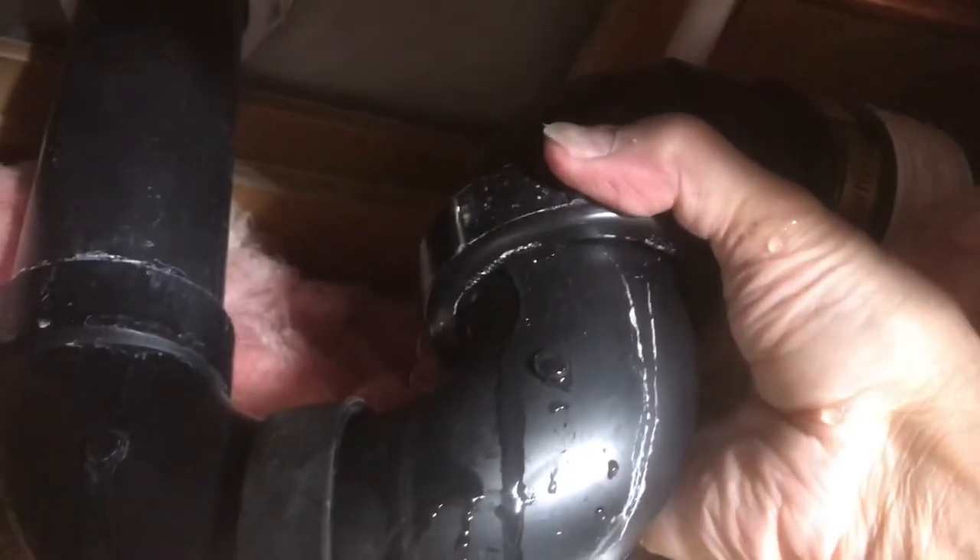You can see the little white residue dripping down there where it was a slight leak in the compression fitting. This is a compression fitting that just didn't seat well, so I loosened it up, cleaned it all up, and then put some Teflon tape on it to make sure it was sealed good. After I got it all sealed back up, I ran the water. I used a strap wrench because I wanted to get it good and snug — I used it to take it off and also to put it back on.